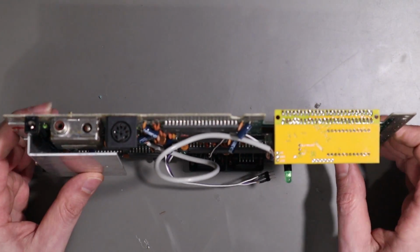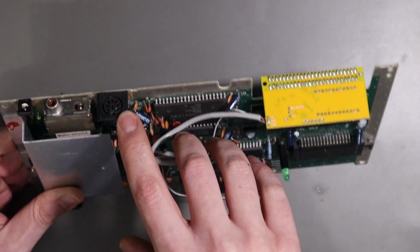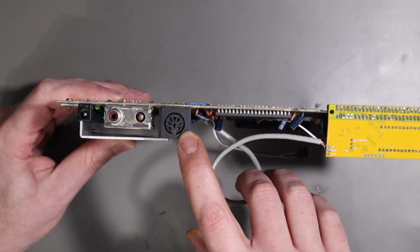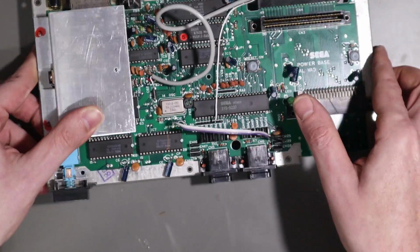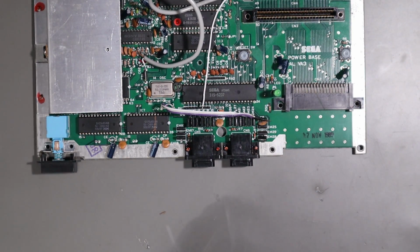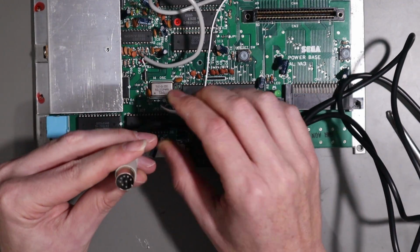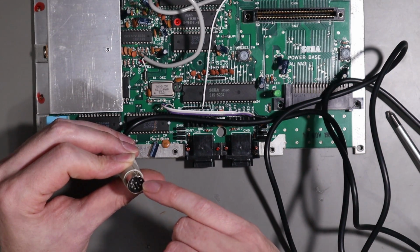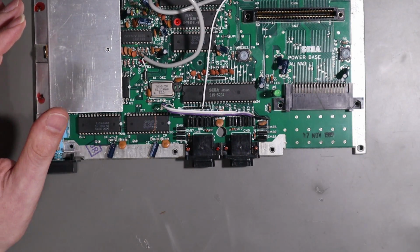I had a bunch of people say that, oh, no, pin 7, which I believe is that one, yep, this one here, already has a sync signal. So I thought, okay, and I took, and we'll get to this bit in a minute, I hacked the plug off because it was a sealed plug off my SCART. I rewired the C-Sync to that particular pin, plugged it all in, and it still didn't work.